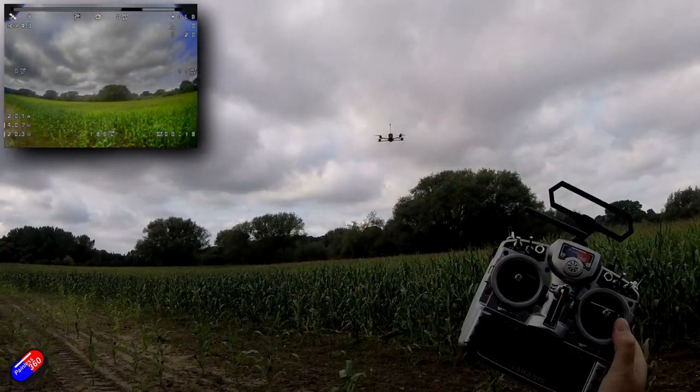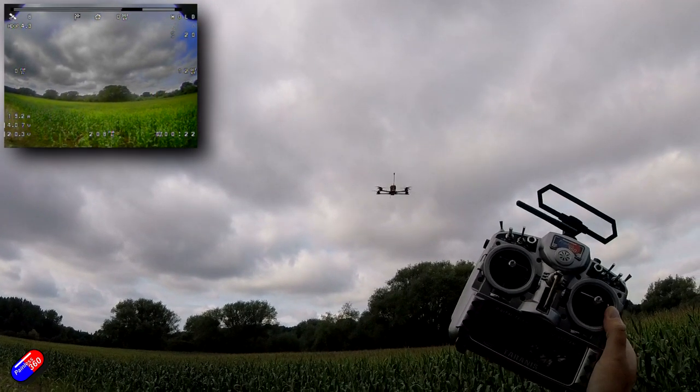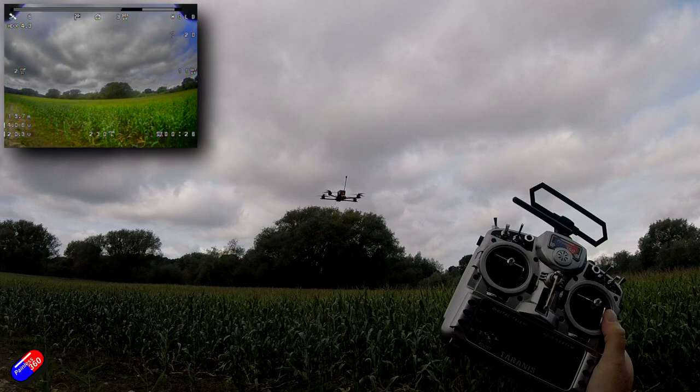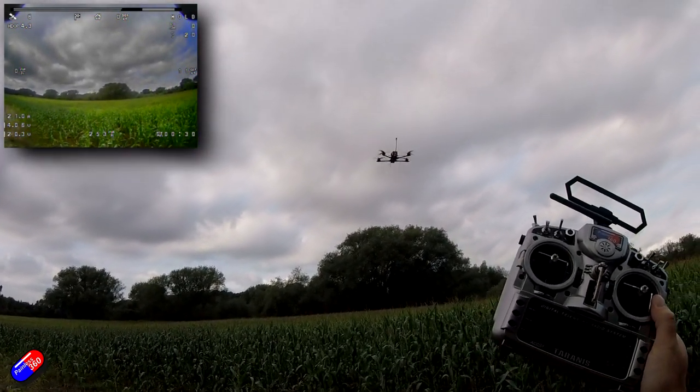And the big test, of course, is just take the model off in Horizon or whatever, as I recommended in the series, and then pop it into nav position hold. If it holds its position well, then your compass is probably going to be all right. If it starts to do that weird toilet bowling, then the compass calibration is wrong, something needs to be checked.